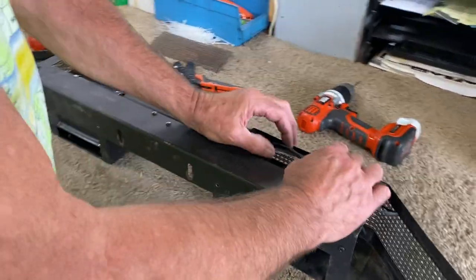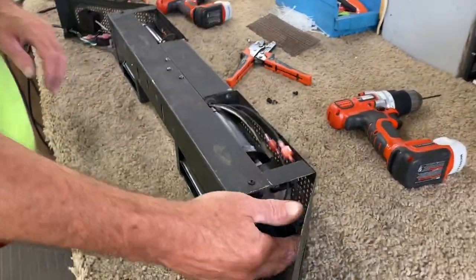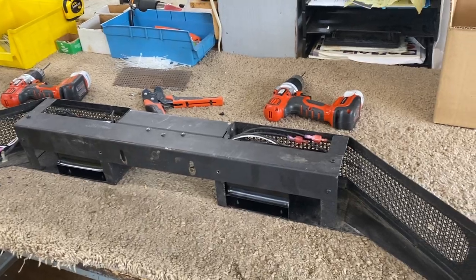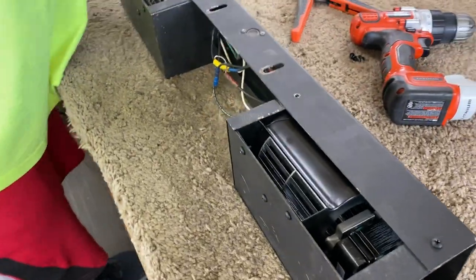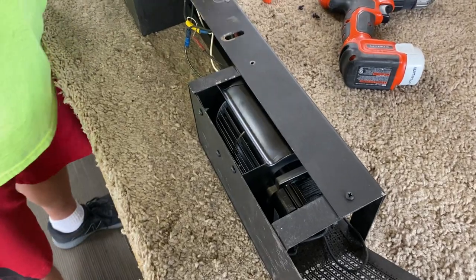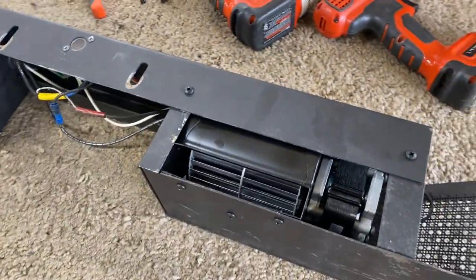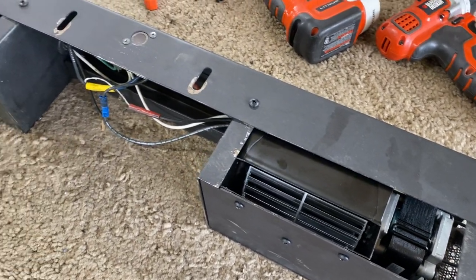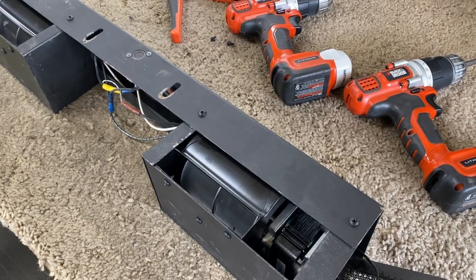A couple of additional points. These things are basically vacuum cleaners — they're going to draw a lot of dust and debris. These are centrifugal style blowers, so they draw air in from the sides. We would recommend removing this once or twice during the heating season, at least getting some compressed air in there, keeping the wheels as clean and free of dirt as possible. The bearings are sealed, so nothing gets into the bearings per se. But as time goes on and you accumulate more dust and debris on the wheels, that adds weight and will off-balance them. Keeping these clean is probably the best preventative measure to prolong their life.